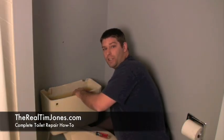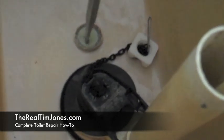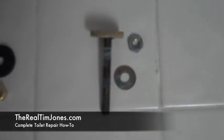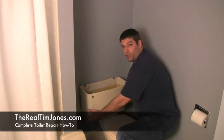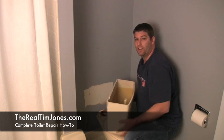The second screw we're taking out is spinning the nut underneath it, so you just need to get the channel locks under there and hold that nut in place while you unscrew the screw. Here you can see the old screw on the right that we took out of the tank. The kit comes with a new screw and new gasket — make sure to use those so you don't have any leaking. Once you've got the two screws out holding the tank on, you can see it's loose. Just pick that up and the tank comes off.